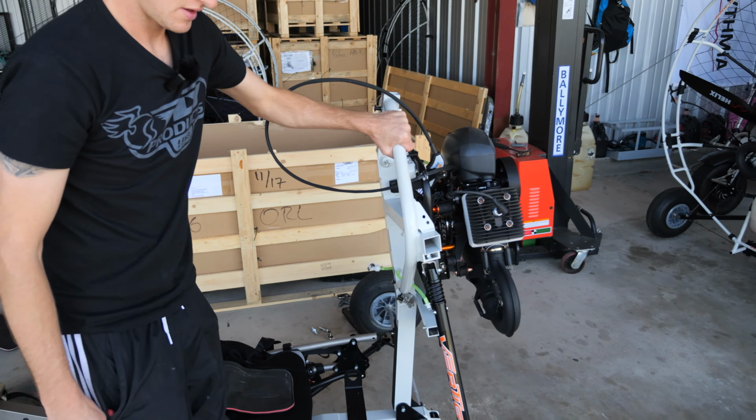to our paramotor. For this bungee, what I actually did was I put a zip tie. You can actually tie this bungee that connects to the pull starter anywhere you want. But my preference is to put a really small zip tie on here, just like this. And then what I like to do is actually run it through or onto my carabiner. And I do this because now if I want to remove this engine, because this is a quick dismount engine for the Moster, all I simply do is take it off of the carabiner and we're good to go.